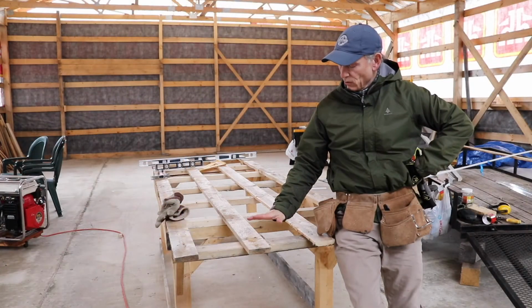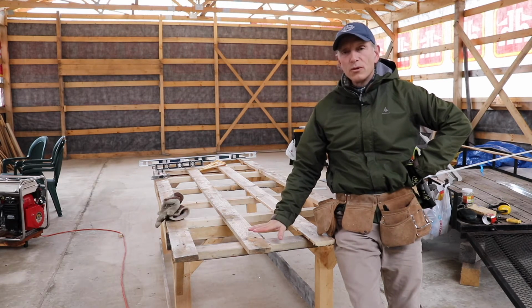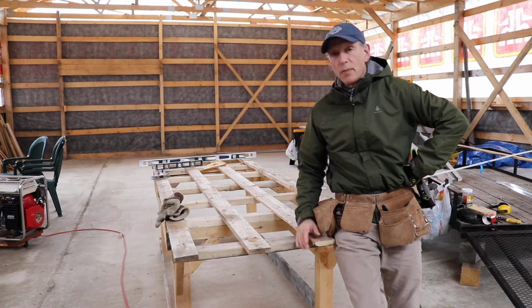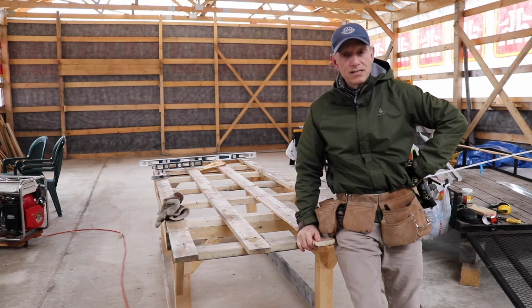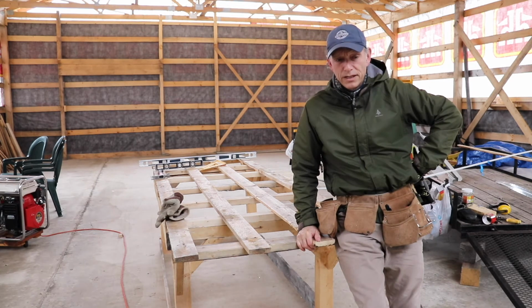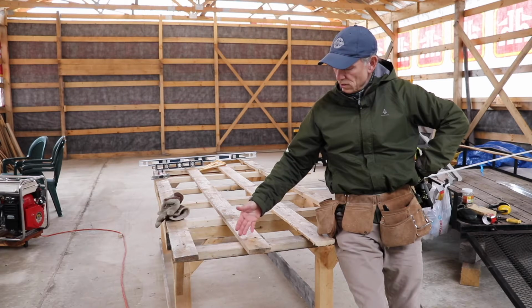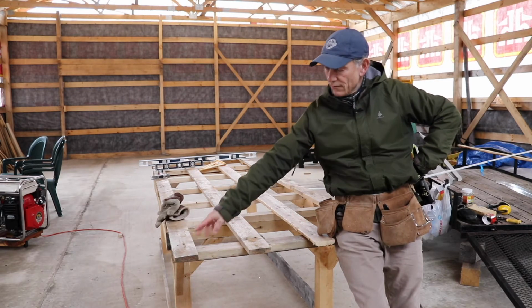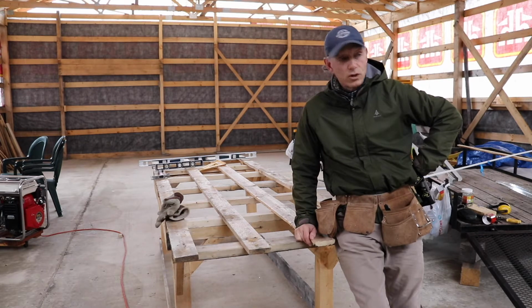And right now I'm going to try to build a workable top to this workbench that I'm developing here. I've got a lot of wood, so I'm just going to take some boards, a thickness planer, 12-inch wide thickness planer I think it is, an old Delta, and I've got an edger. And I'm going to cut up some boards 42, 43 inches long, so it'll have a 2-inch overhang on each side. And that'll become the work surface.